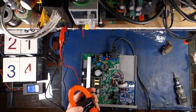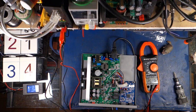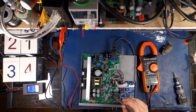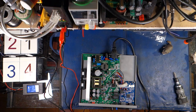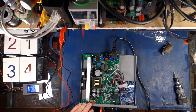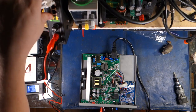Always err on the side of caution — nobody is an expert, and if somebody says they're an expert, run like hell. Let's plug it in. 55 volts on the dot. So keep that in mind, guys — this thing is floating at 55 volts out. If you're using anything that says it cannot handle up to 57 volts, be careful. Let's hook up some load. I'm going to hook up load A. Sparky spark — yes! Our PoE is coming online. I've got three devices: Cisco AP, Cisco AP, and M2 feed horn.